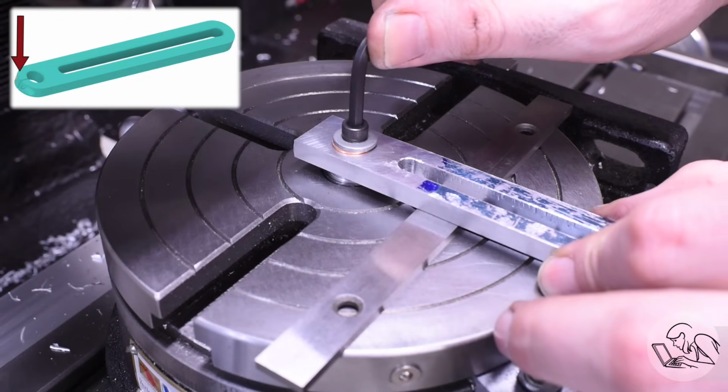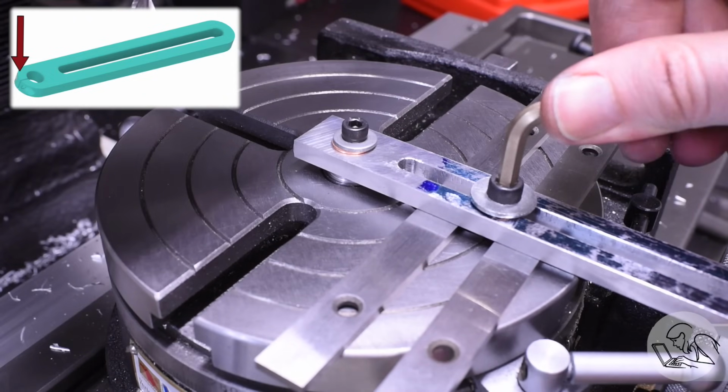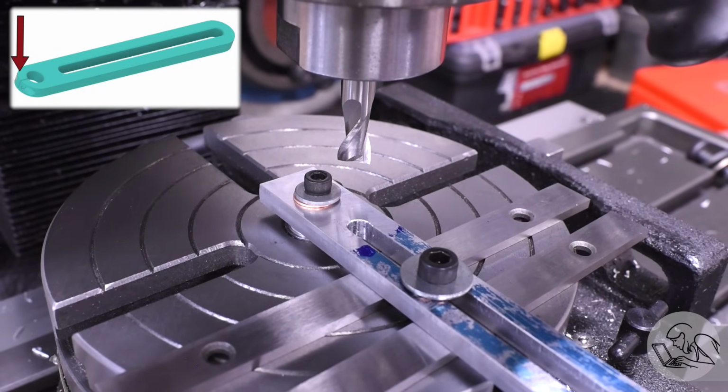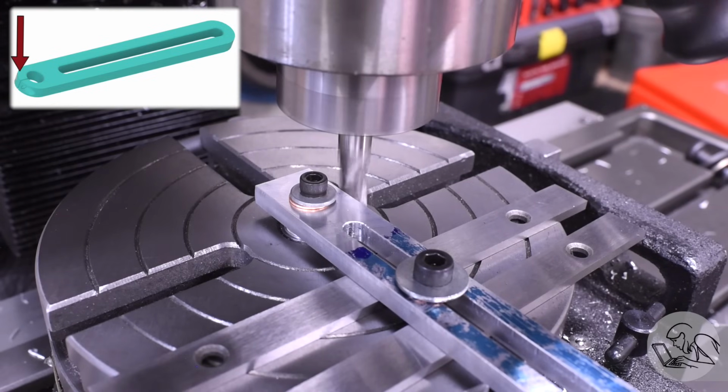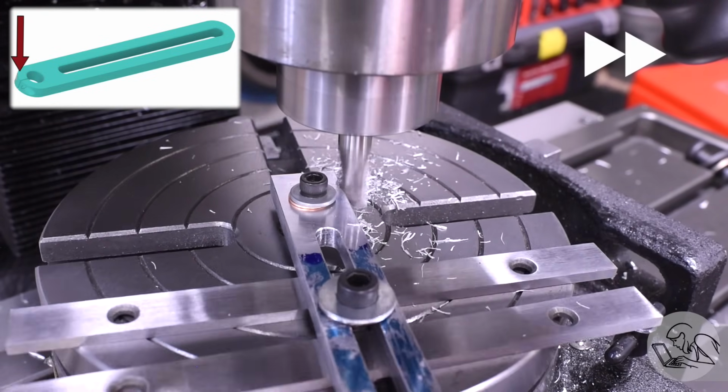And a simple 180 degree end rounding like this is very, very easy, much simpler than what I was doing earlier. For this, you just translate over the radius of the cut plus the radius of the end mill, and then run it around from 0 to 180 degrees. Could not be simpler.